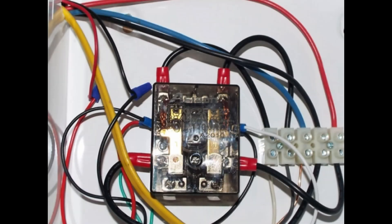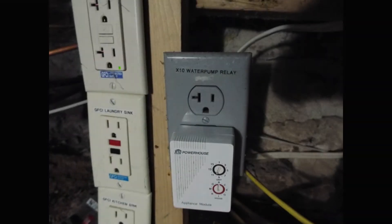To wire up that LED: the LED wires in the upper left come down as red and black and go to the two blue wire nuts as shown. On the red side, it swings around and goes to the contact on the left-hand side with a loop connector; on the other side it goes where the black wire goes. At that point the LED will light when the X10 is tripped.